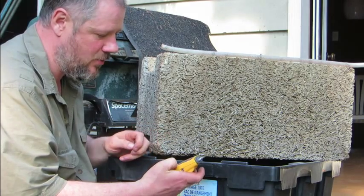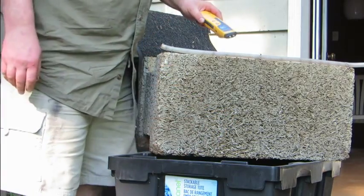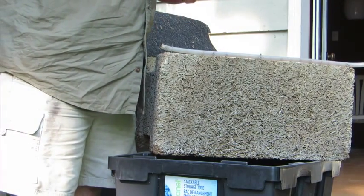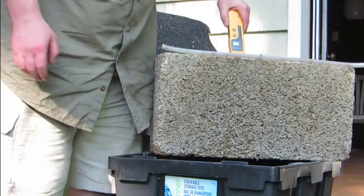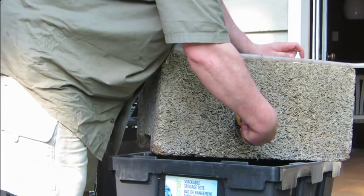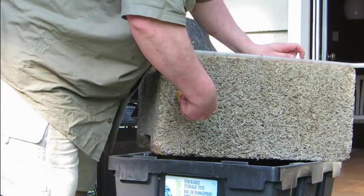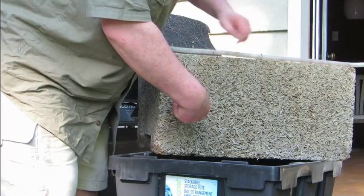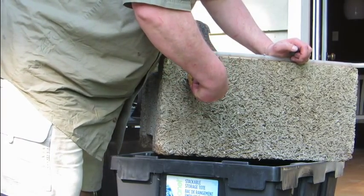Now we're going to see what the actual readings are. I'll take some photos to embed later. I'll put it on actual moisture. We're at 99% at the top edge where it's been dumping - 99, 99, 99, 99 across the face. There was a drier area where the hole was plugged, but it's reading 40 and 75 - so not that dry either. Then back to 99.